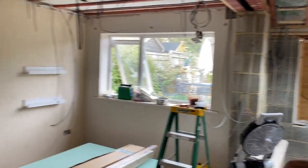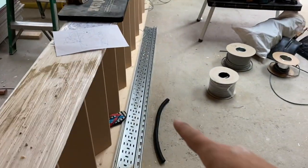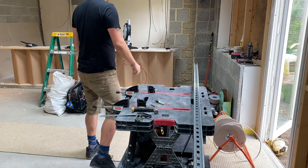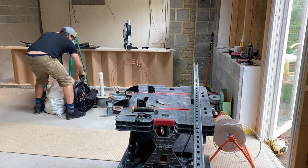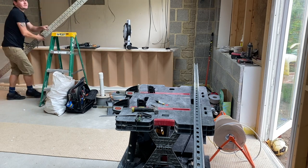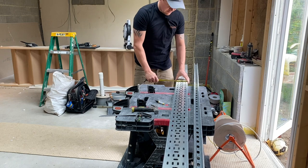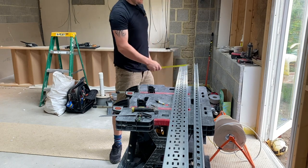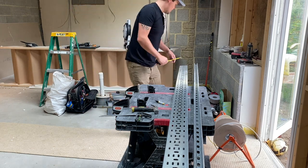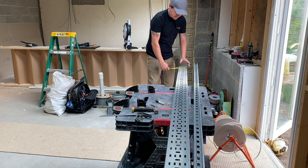Getting there now — all my cables are getting dropped in where they need to be. Heating tomorrow and I'll do a bit of tray. I'm just about to do this bit of tray that goes up and down this wall — it's the easiest way to get all those cables sitting nicely. I picked up four-inch tray and some light-gauge unistrut. There's no standoff, so I'm going to cut four standoff brackets in unistrut at exactly the same width — four inches.